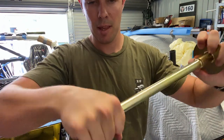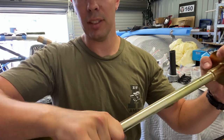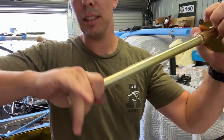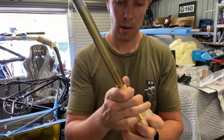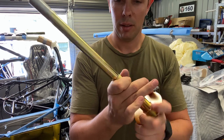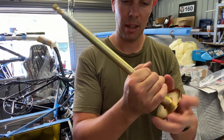It's actually coming off a lot easier than I anticipated. You can see it's quite a bit shinier. We might touch it with some 1200 grit just to make it as smooth as possible, which means the nylon bearing slips a bit nicer and lasts a bit longer. Do the same up here for the upper one. It sort of doesn't matter too much — the anodizing doesn't provide much protection where this is, being within the cabin and not exposed to anything.